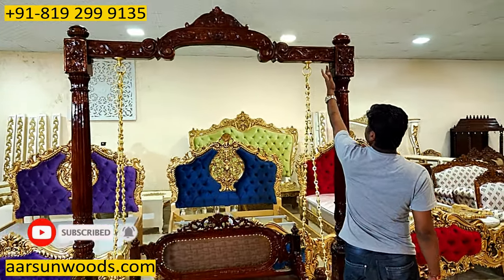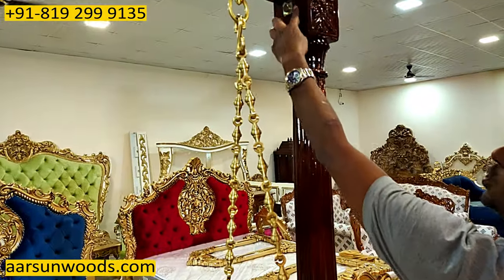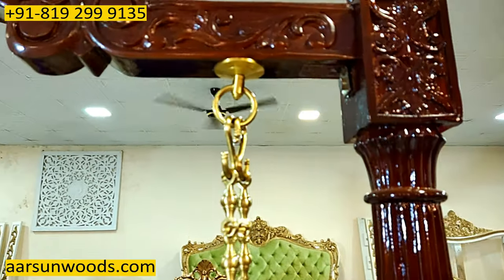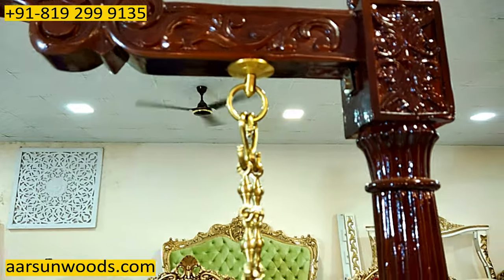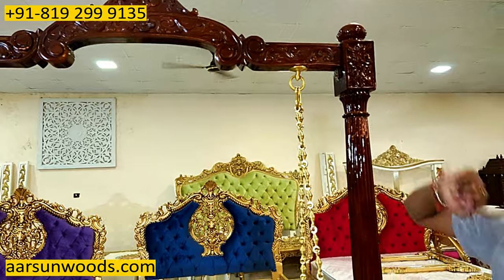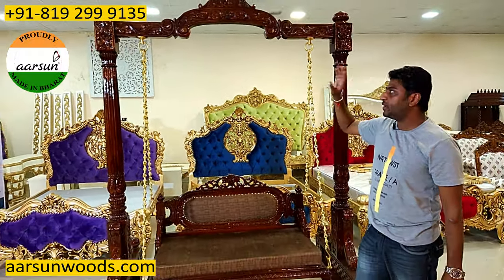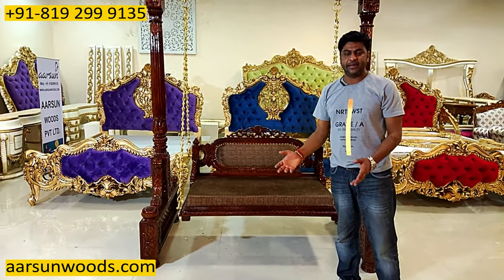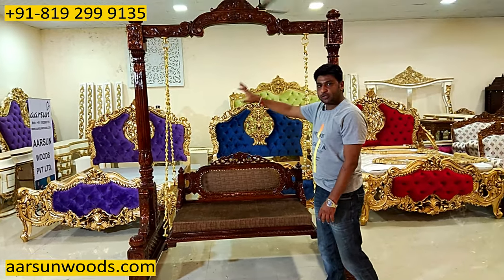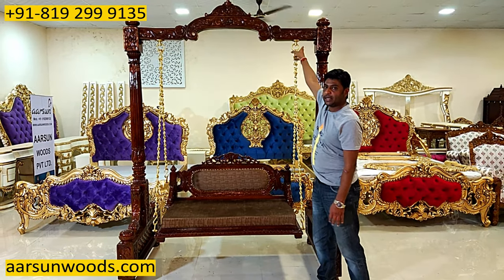Another thing I'd like to point out is this bolt. If you see, there's a little gap between the two strips here, and this is done intentionally. It has to be there — when you tighten this bolt it doesn't go all the way. There are technical reasons for this, and it applies to all items we have with this bolt system — beds, folding tables, and this as well. So when you install it at home, please remember this is done intentionally. The gap has to be there.